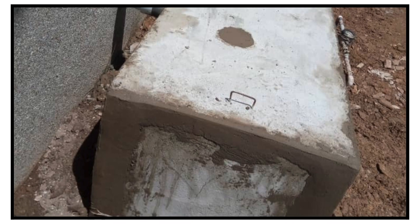When you flush from inside the house, it comes into the digester and the water drips out into the pit or whatever drainage you have. If it's channeled into a soak away or a gutter, that's even better. But when there's no access to a gutter and a soak away would just fill with water, the best option is a French drain or drain flow system.